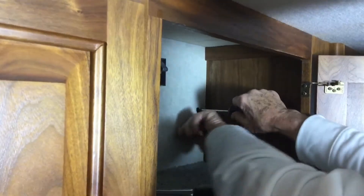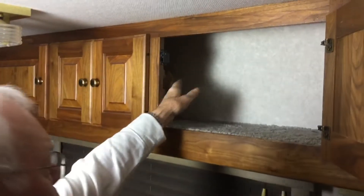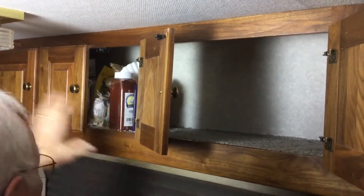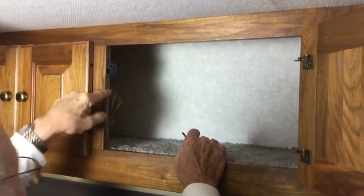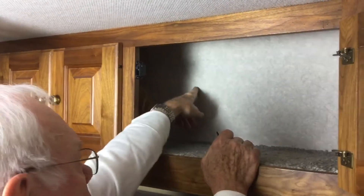This is the top screw. Now for the other side, if you have a cabinet that has no wall on one side — such as this cabinet, which is a continuous cabinet — you want to mount the anchor loop four to six inches from the bottom of the cabinet and straight back from the edge of the face frame on the rear wall.